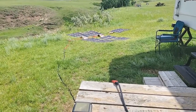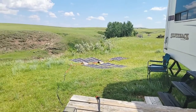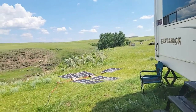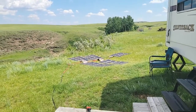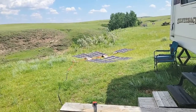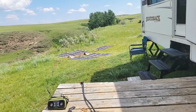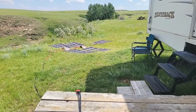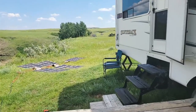So realistically, if we had those 1200 watts laying on the ground, they would have been producing well over 1100 watts based on what we're seeing, because with the grass they'd absorb way less heat. So where I'm going with that is: when you're laying out your solar — be it our solar blankets or any solar — if it's anywhere that it's going to absorb heat, let's say if you lay out our solar blanket on your concrete driveway, keep in mind not only is the solar blanket absorbing heat from the sun, it's absorbing heat from the concrete. Another example: I have 4,400 watts of solar on my garage. My garage has black shingles. My solar is also black — I did that purposely. The negative thing to that is on hot summer days, unless I'm up there with the hose hosing it off, I'm not getting the results I'd like to see.